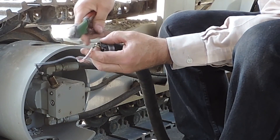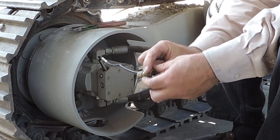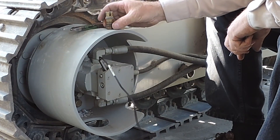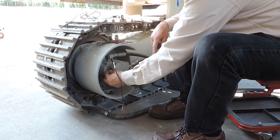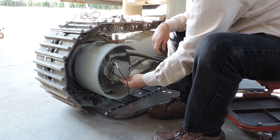Now cut the wires. Remove the brass hose barb from the motor housing — it is held in place by a set screw to the right of the barb. Next, loosen the set screw that secures the pulse pickup from losing its adjustment. The set screw is to the left of the sensor.